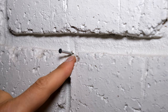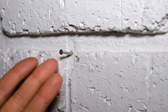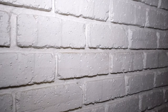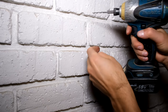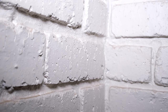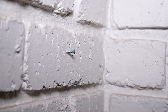Now with a painted face brick wall, when you hit the nail into either the brick or the cement, some of the paint comes off — even if you hammer the nail correctly it still opens up some of that paint. You can see I barely started and some of the paint is already coming off. I haven't done anything wrong here, it's just the nature of hitting a nail into a wall. Therefore, rather use the hack of drilling a small pilot hole first. You could use this pre-drill method so that you do not damage any of the paint — for example, pre-drilling just a few millimeters into the cement or into the brick, following the same procedure. There you can see the result in the brick without damaging any of the paint work.